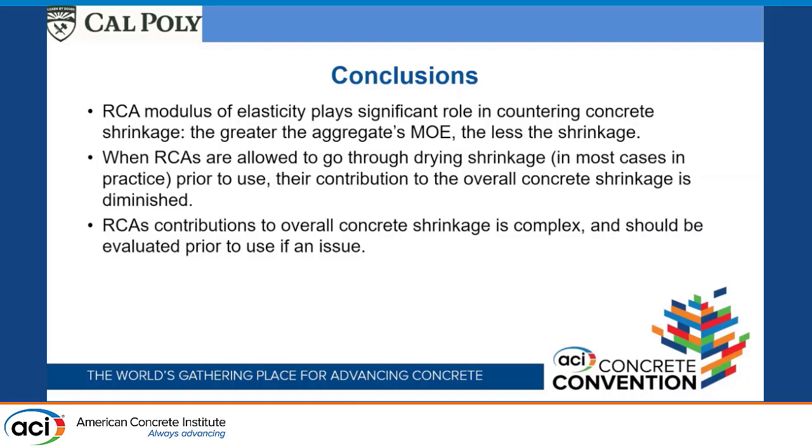Thank you for a wonderful presentation. The question, when you did the shrinkage, because I saw two samples, two mixes have different shrinkages. Did you take the average of 3 prisms, or how did you do that? I think it was the average of 2 prisms. As I'm trying to recall, yeah. But it was not 1 prism. It was at least 2, if not 3.